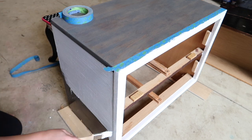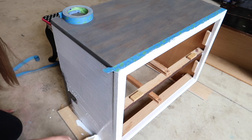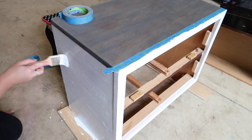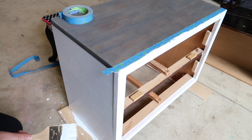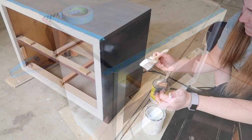When I am doing my painting projects, I always brush the first layer on and then roll the second coat. I definitely needed a second coat here because there was really dark paint on there before. So I'm going to brush the first coat on, roll the second, and that will give me the nice good coverage I'm looking for.